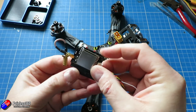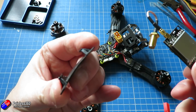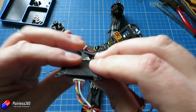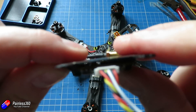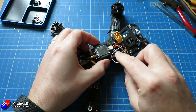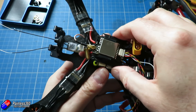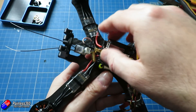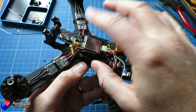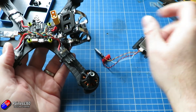If I'm using smart audio settings to set everything up that should work. I can bend the holder, it'll snap in and hold the VTX in place, and I'll put a little bit of tape under one side to keep it secure. That fits over the top of the flight stack, held on with a couple of nylon bolts that space everything beautifully — so that's how we're physically going to install it.